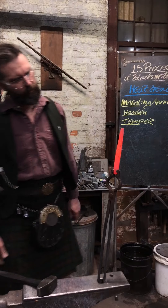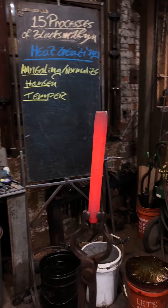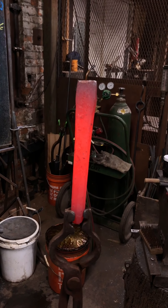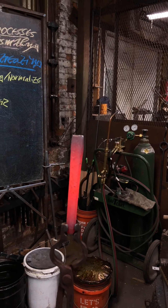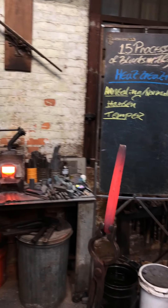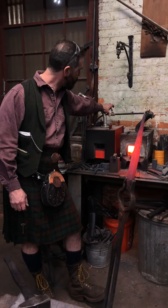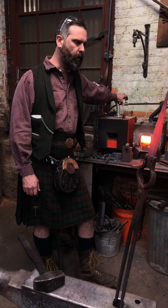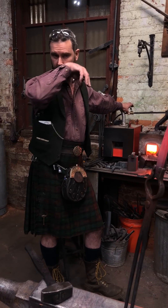That's fine — it's not the most beautiful thing in the world but it'll work very well as a chisel in my tool kit. First thing I'm going to do is choke this fire down. It's been running for about 30 minutes now, it's got a good bright ambient temperature, I'm not fighting any cold spots. I'm just going to bring it down and see if I can get it to simmer somewhere a little over 1600 degrees.